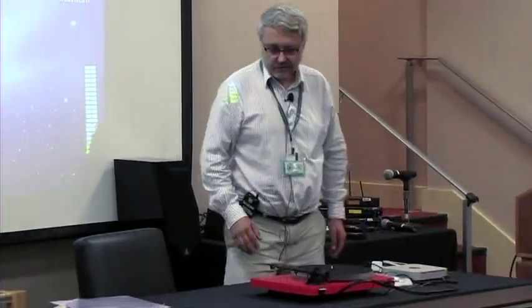On vinyl, it's a different story because generally this is sourced, especially old vinyl, from analog sources, and some of these mastering tape decks can reproduce signals into the hundreds of kilohertz range. So a lot of that information is actually transferred to the vinyl, and I'll show you that it goes to at least 100 kilohertz because there's no brick wall on vinyl. It's a gradual mechanical roll-off, much gentler on the music than a digital filter.